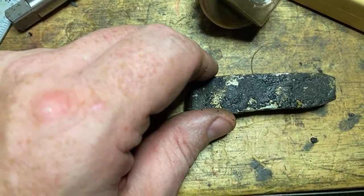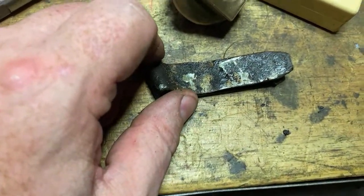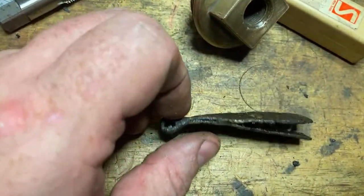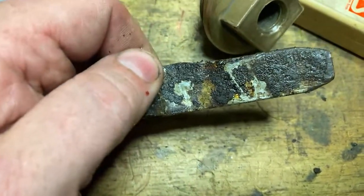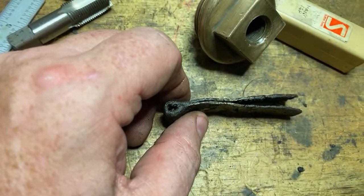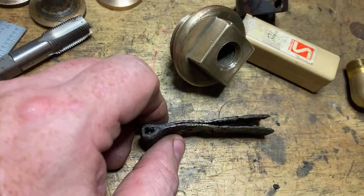It's rotten stuff. Not much moves it. And Citrus 6000 ultrasonic degreaser moves it eventually if you warm it up and soak it for long enough. Hey Russell, but everything's covered in this crap everywhere. And some of it's a quarter of an inch thick. So you just got to scrape it off and scrape it off and scrape it off until there's none left.